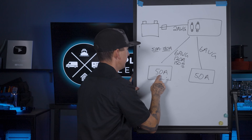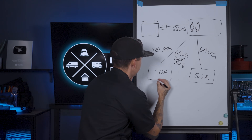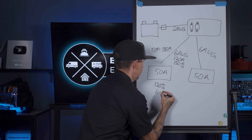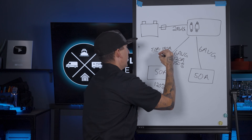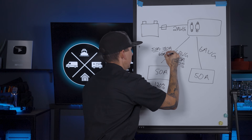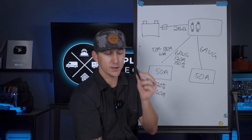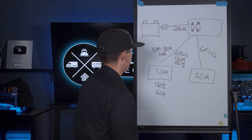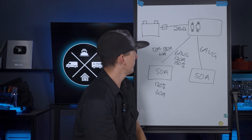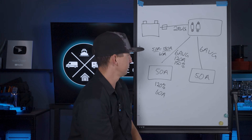Knowing we have such a big range, my rule of thumb is 50 amps times 120%, which gives us 60 amps. So our recommended ballpark fuse size is 60 amps. A 60 amp mega fuse for the Lynx Distributor exists, and that's exactly what we have here — that would be perfect. But if this figure recommended 65 amps, I might bump up to 80 amps, and that 80 amps is still within the range and will work just fine.